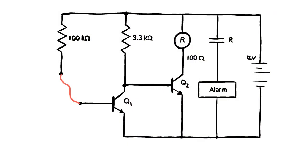We need to work back through the circuit just like we do with any other transistor. We know the base-to-emitter voltage is 0.7 volts, so we end up with 11.3 volts at our base resistor. We take the base current and multiply it by beta to get our collector current. First we get base current: 11.3 divided by 100,000 ohms gives us 113 microamps.